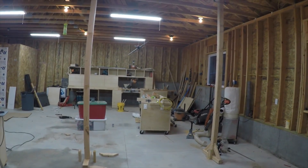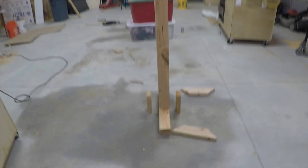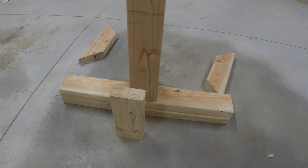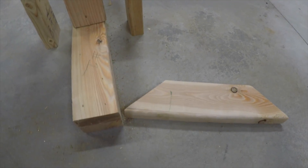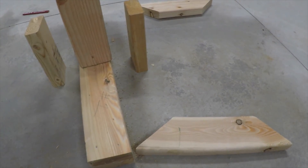Now I've got the post for this lifting device erected up with a couple of clamps holding it plumb. I'm going to make the feet — I've already got them kind of cut. There's the foot acting as a spacer since my ceiling height is about ten foot three inches. I'm making it into a more supportive foot using cut-down two-by-fours as sandwich plates to fasten the foot to the post, plus some triangular truss pieces to add rigidity — not really for structural pick strength, but to keep the foot solid and intact to the post.